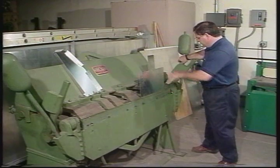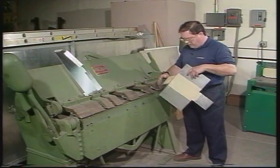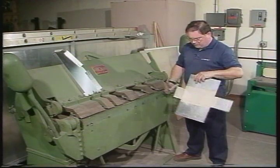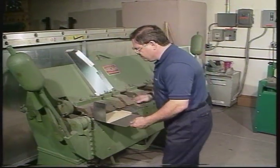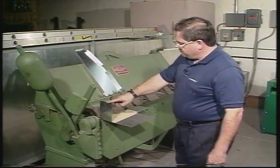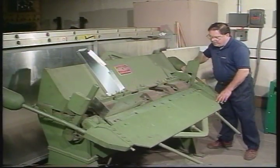Now I've got a square right here. I'm going to pull this out and check it for squareness. I'm going to touch over — luckily this is aluminum and I can move it around really easily. We'll come over here for the second bend. Notice when I make this bend, the short section of the box will just drop in here out of the way. I'll try not to go past 90 this time.